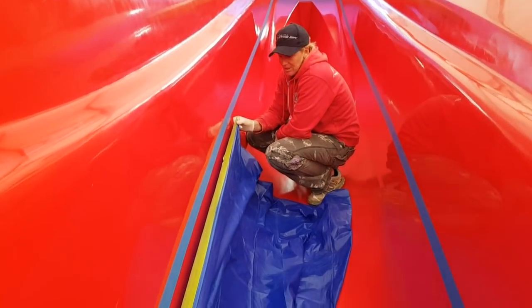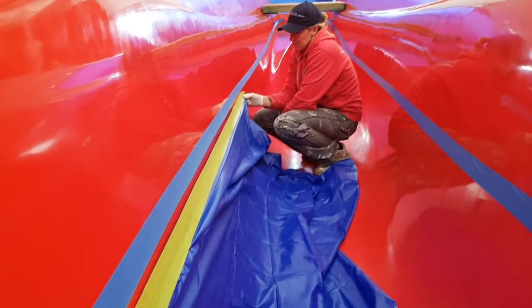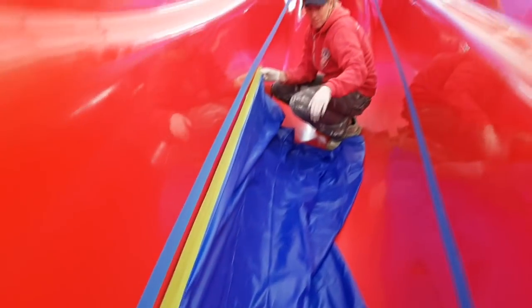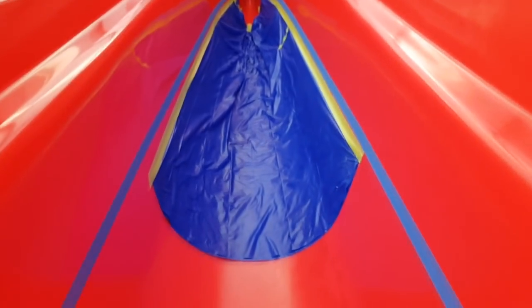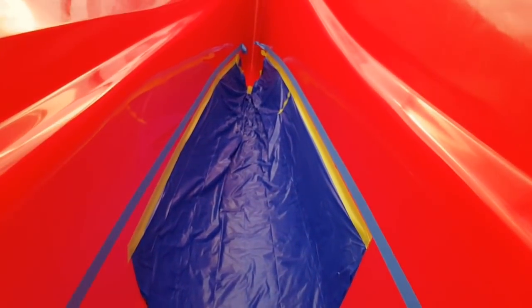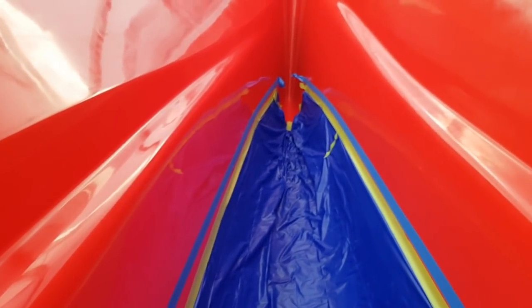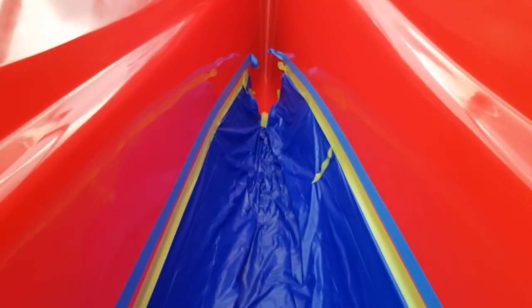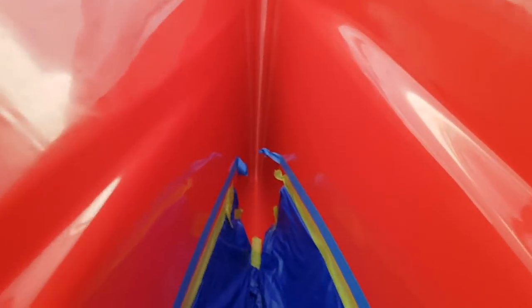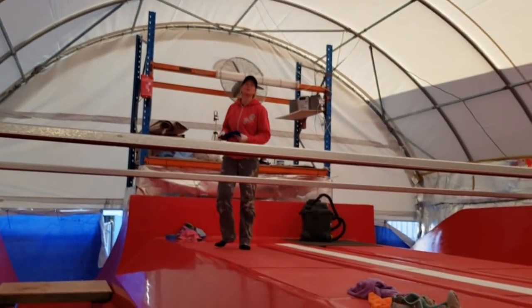What's going on here, Trace? A little bit more from the blue line at the moment — I'm trying to match these two up, a little bit of a gap so that we can walk in here and spray. The blue line gives me the separating line; the blue sheet gives me something to walk on to spray off so I can do the sides, the chamfer panel. Then we're going to remove the blue line which will separate between the gel coat and the sheet, and I'll be able to remove my plastic and get a nice clean line. Way below the water line so it won't really matter. The perfect plan — what could possibly go wrong?